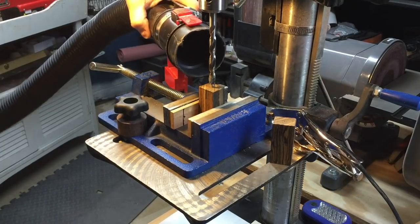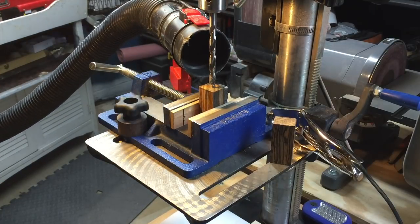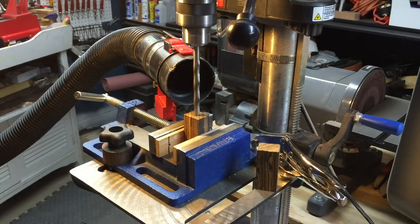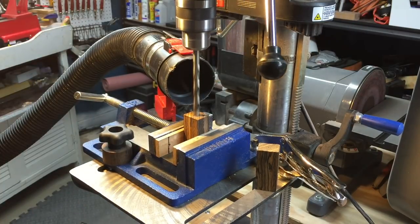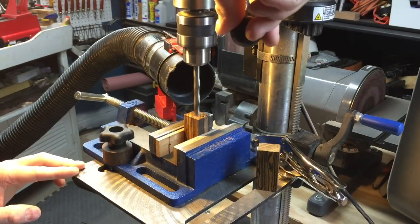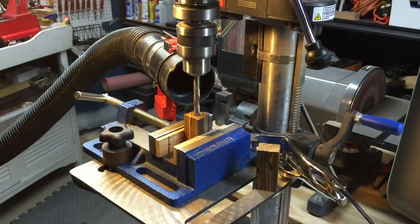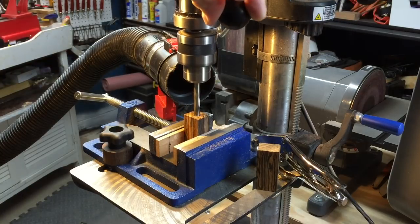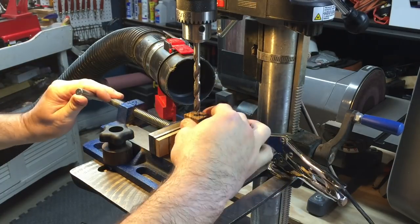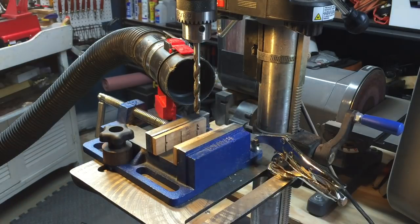Once I'm aligned and centered with the drill bit, I'll attach my magnetic dust collection hose to pick up all the dust. I'll drill the hole in each of these blanks doing small relief cuts in and out so the drill bit doesn't get very hot and to clear out the dust. It's less likely that you'll destroy the wood piece this way. Also, to avoid the glue not sticking to the wood on the inside, make sure you try not to burn the inside or make the walls of the hole too smooth.